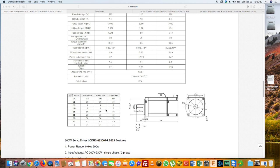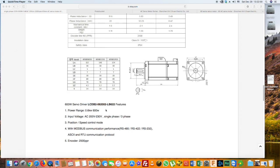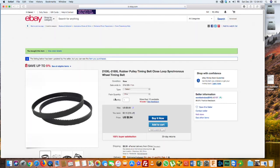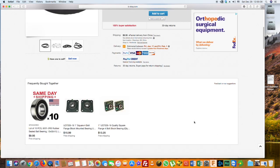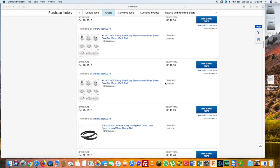Now that we have decided on the motor, it is necessary to think about transferring the rotation from the motor to the spindle. Let's keep in mind the shaft of the motor is 14mm and the spindle shaft is 28mm. The most optimal is the timing belt — it does not slip, does not require strong tension which reduces wear of the motor and spindle bearings, and runs almost silently. The servo motor has a built-in encoder, and in order to use it, we need a gear ratio of 1 to 1. Therefore, we need pulleys for the motor and for the spindle with the same external diameters and the same number of teeth.